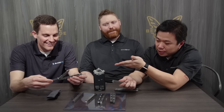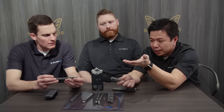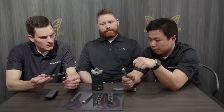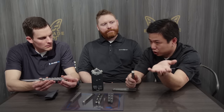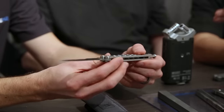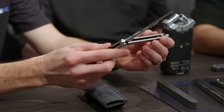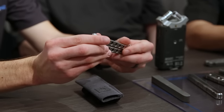That being an example — that's a cast titanium handled knife. Cast titanium is exactly what it sounds like: they'll basically take molten titanium, pour it into a mold, and form these handles. Because of that process — I like to use the jello analogy. Anybody who's ever made jello: you take liquid jello, pour it into a mold, you get these little bubbles in it. In terms of casting metals, it's called porosity. You get basically these sponge-like voids that occur in the material as it cools and hardens.